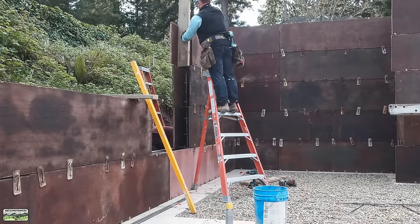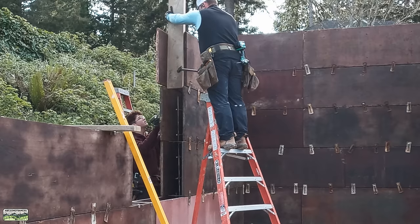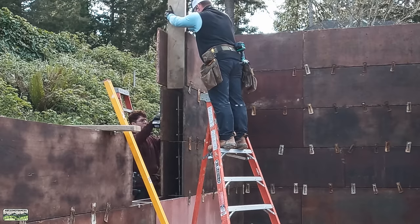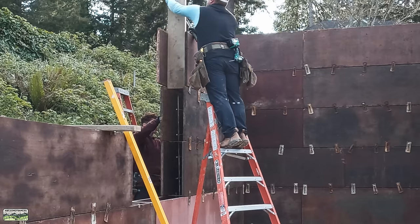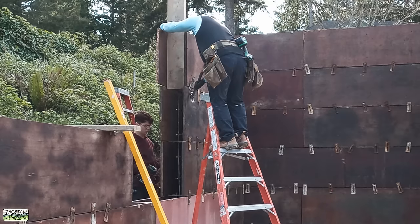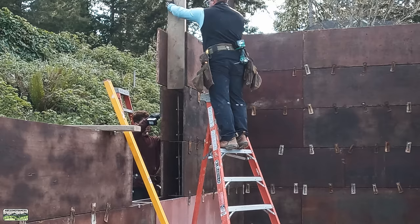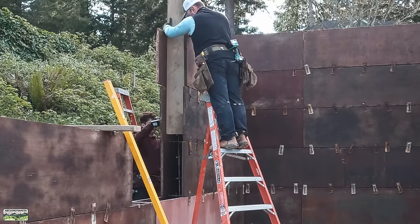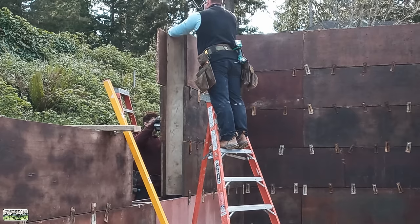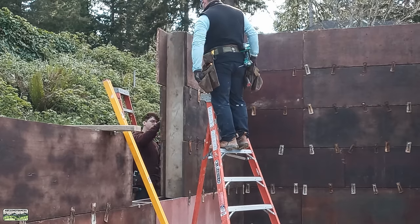Where my ladder is currently in this portion of the video is a bedroom, so we need a window big enough for egress and a window well so somebody can actually climb out in case of a fire or disaster. I go from 10-foot walls down to 8 feet, then down to 2 feet for the window, back up to 4 feet, and then it goes behind the camera — that's just for dirt grade. You can kind of see the neighbor's driveway up on the top left. As we frame this house later this year, I'll be curious to see how this all works out.